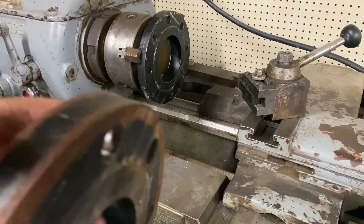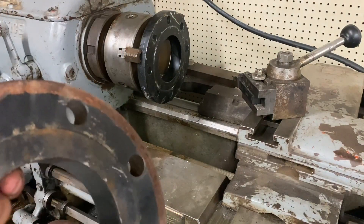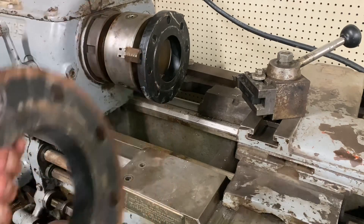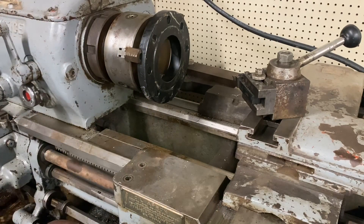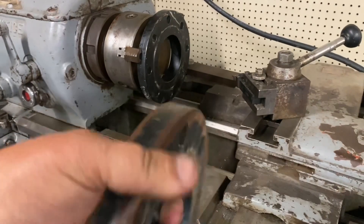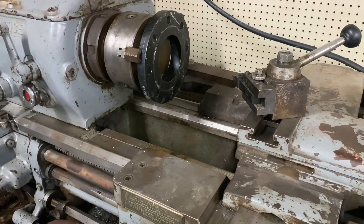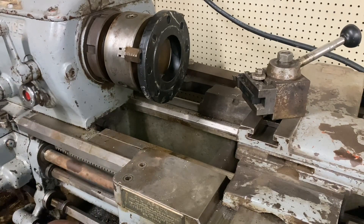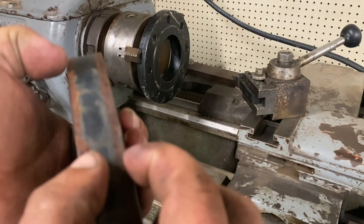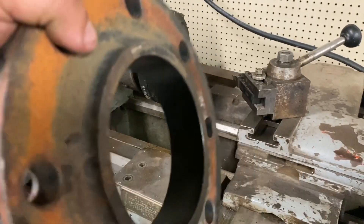That way he has a proper set of flange spreaders that clamp on both sides — they have a screw that spreads them apart — and he'll use that for replacing gaskets or disassembly. These are 150-pound flanges and he's running 60 PSI. These thicker flanges are way overbuilt, but of course if this were any higher pressure I would not recommend modifying them. I always recommend to anyone welding to get these thicker flanges — you can make up a lot of misalignments with them.